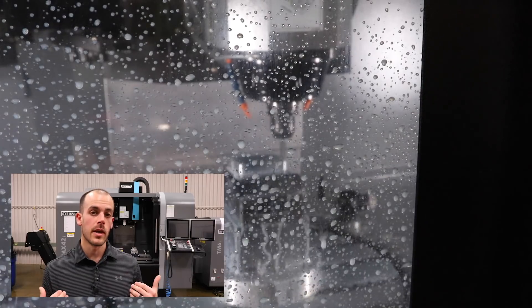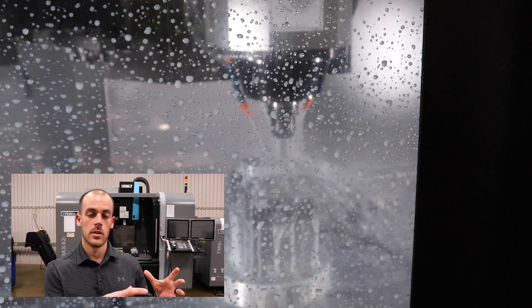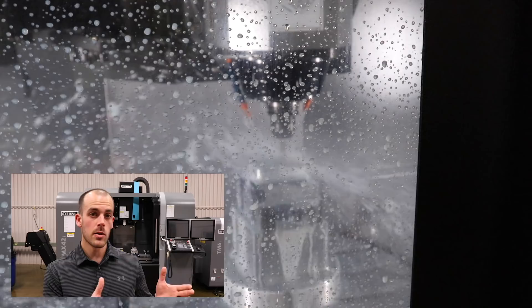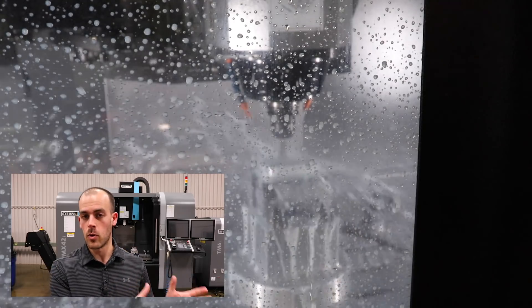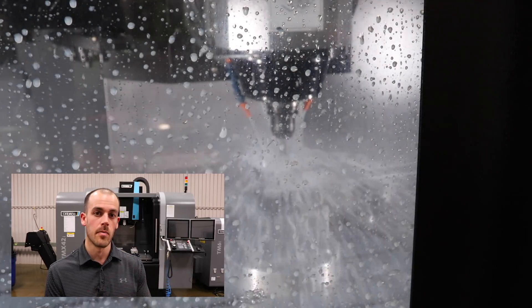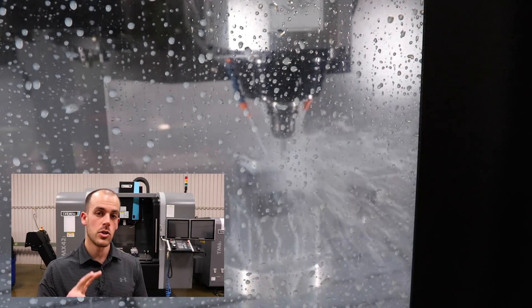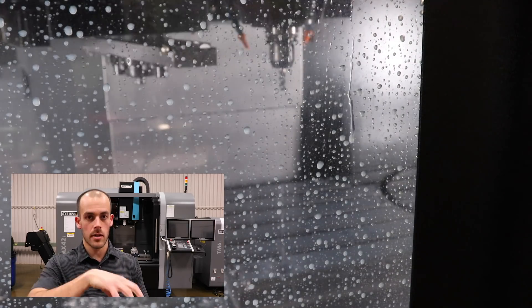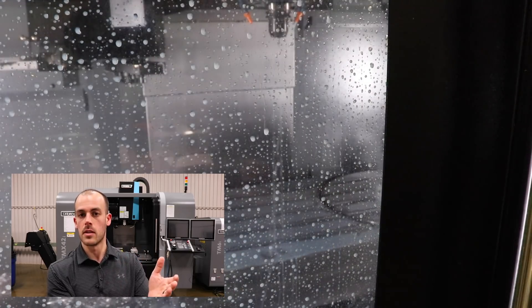For me, this was a great learning opportunity to see the process by which you would utilize a piece of CNC equipment to cut out a final part. So even though it's a computer numerically controlled piece of equipment, you still have to think about how the part is actually made. My particular part was two ops, meaning we fixtured it one way, did one series of operations, flipped the part over, and then finished machining the back side.